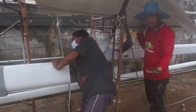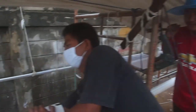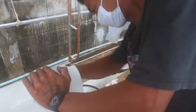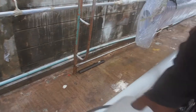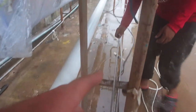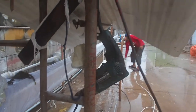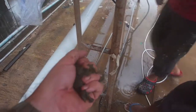But more importantly, take a look at this. That is the old mouse. You can see Dang is pulling out the remainder of the bits of the old mouse. How have we got it out? This is Moo's cunning idea - it's a 25 millimetre drill bit welded onto 5 metres of stainless steel rod, attached to the drill. And he's drilled his way through this great big lump. Look at this - it's amazing, it's a mass of molten nylon.